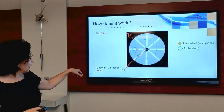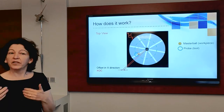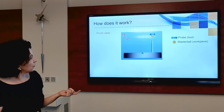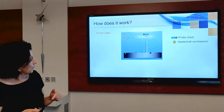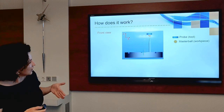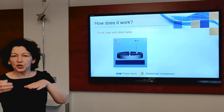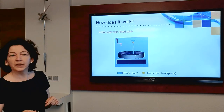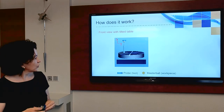From those errors we can measure what the errors on the table are. This is the so-called XOC — an ISO error representing the X offset of the C axis (the rotary table): how much it's offsetting in X and how much in Y. We can then correct it and make a better machine. Looking sideways on, you again see the offset between the real and expected position going in and out of synchronization. If the table is tipped relative to your linear axis, it will go up and down as you rotate. So we can do a full 3D error analysis — looking at these errors in all three dimensions.